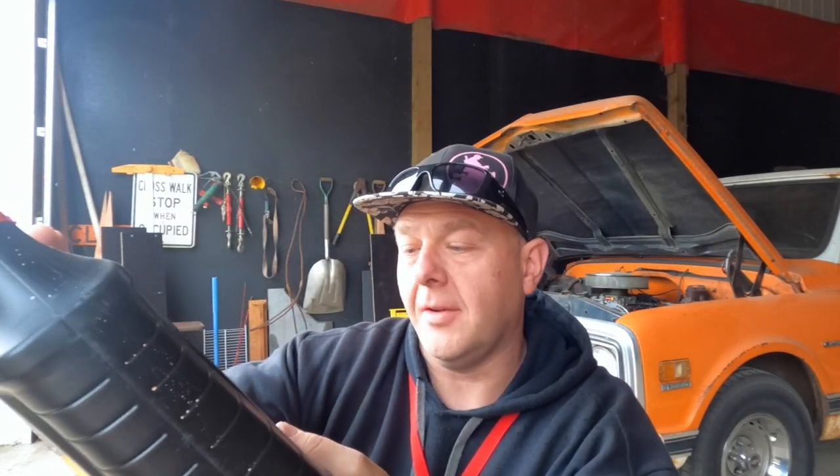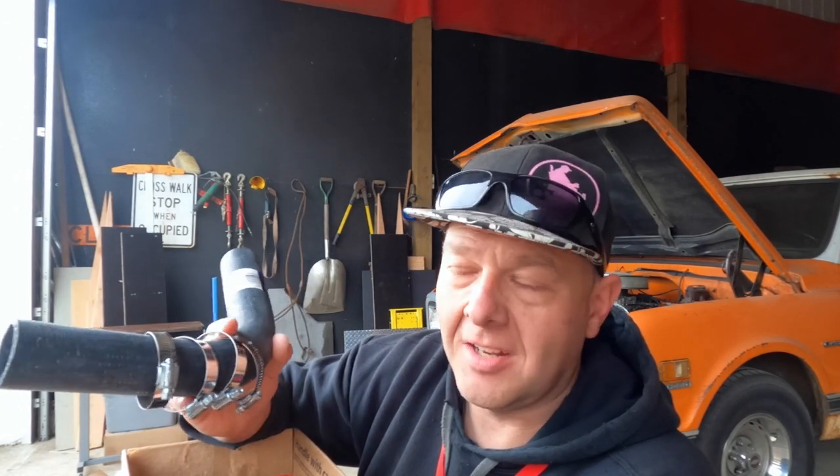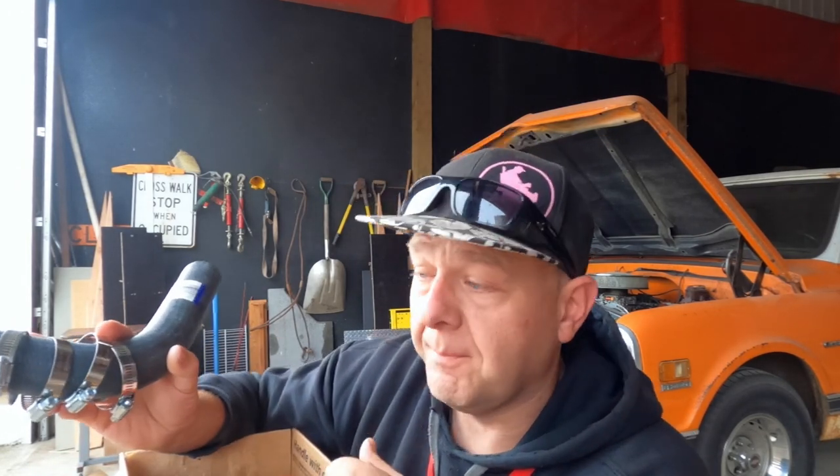I got some of this Peak pre-charged diesel coolant - the cherry red stuff - with an 800,000 mile rating. It's pretty nice weather today, I think I might try and swap this hose. It's one of those things that could potentially get out of control in a hurry - if the parts are rusty enough that things break. There is a hatch inside the back of the bus that allows me to get right to it. I need to take care of it before the weather gets really cold, because right now if you build any pressure in the cooling system it just starts leaking.